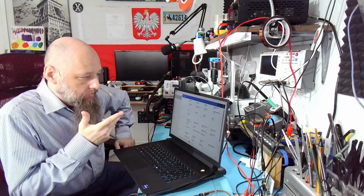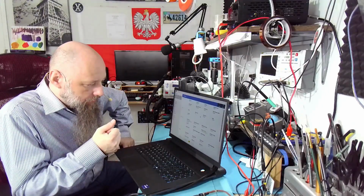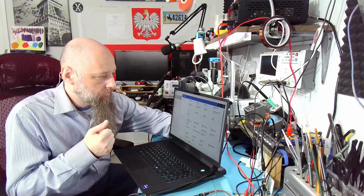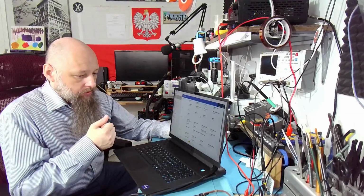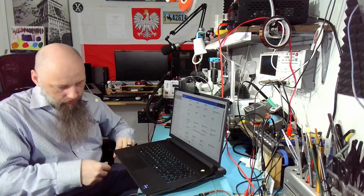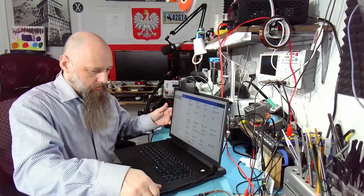But now I'm thinking something else is the problem. Why? Because it's overheating in the BIOS. It's spinning the fans like crazy. It's not supposed to be heating up in BIOS like this. So something else is wrong. It sounds like it's running some modern game. It's already disassembled, but I don't know if the back comes off or the keyboard comes off.